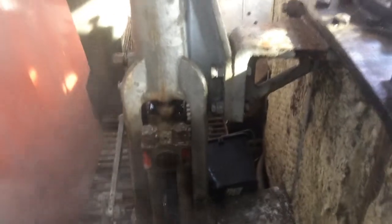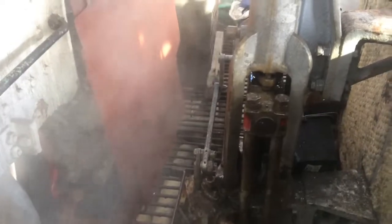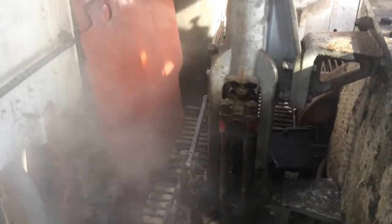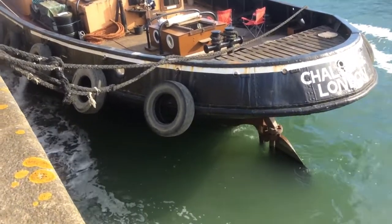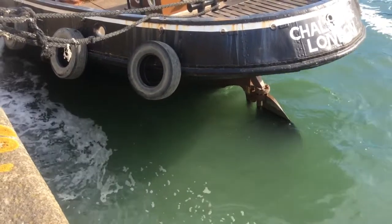And when you're ready for standby, you shut the oil and drain. This bit of kit here is the steam reverser. By moving that small lever downstairs, what you effectively do is you're able to move the reversing gear just by steam. Which for a vessel used for manoeuvring, that's what you want — power reversing. If you look, you can just see the screw turning there, down ahead of the rudder under the water. Just getting a glimpse of the blade going past.